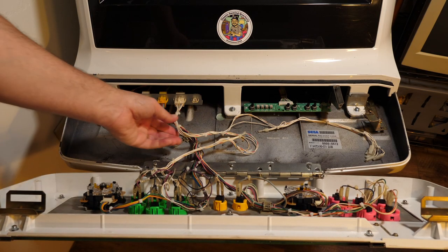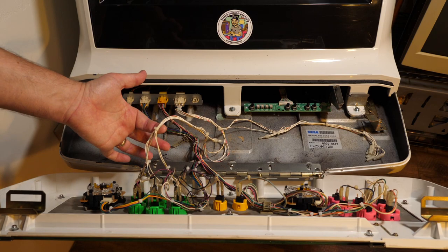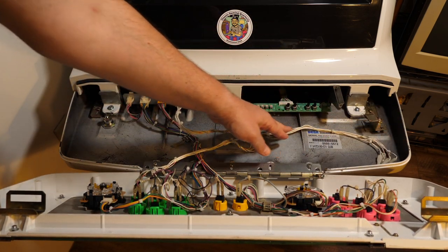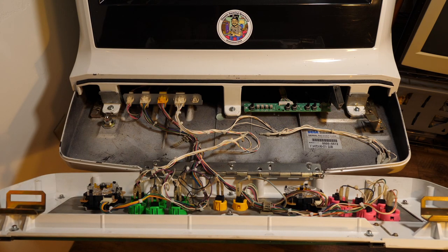All right, so I've popped in the other Capcom CPS board. I was already down underneath there putting the board in. I put in the little extra button adapter to go from the board to that Amp connector that the Astro City uses. And then I put the extra button harness in the control panel, although I only bothered wiring up player one for obvious reasons.